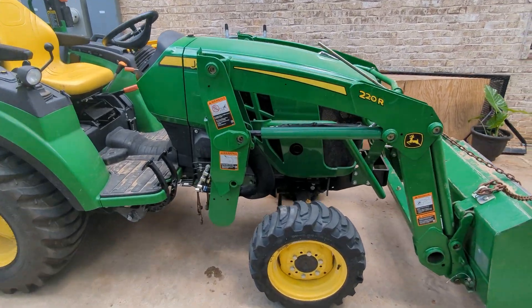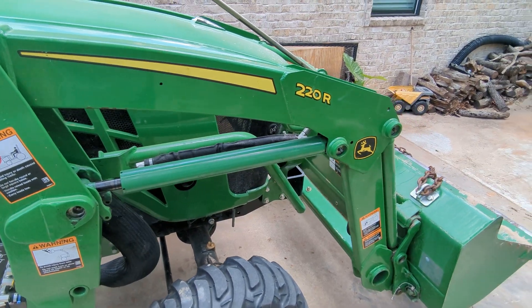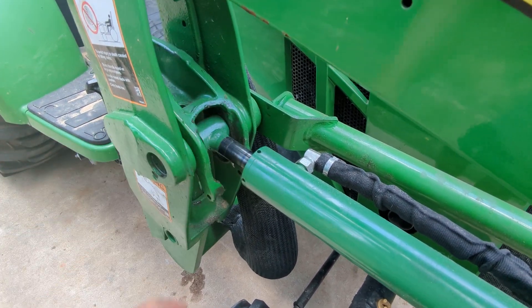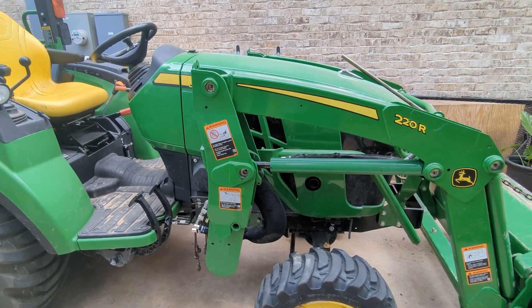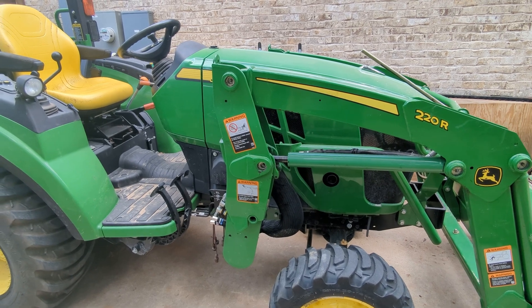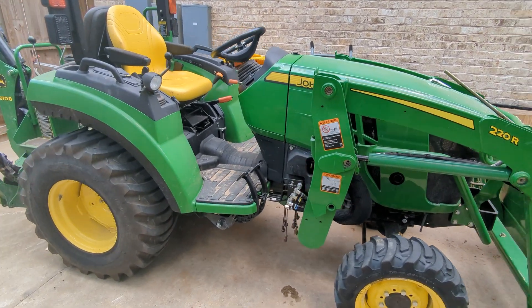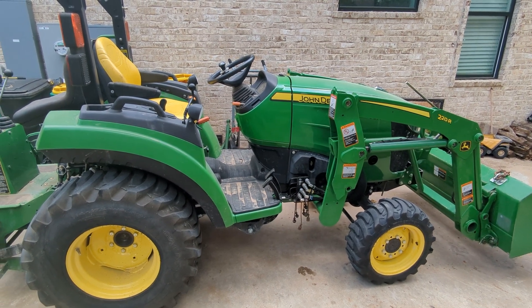What we're doing today: we've got the 1.75-inch bore cylinders. You can see there's no interference here, and this diameter will fit between here as well, so no issues around scraping on the end side. I think this is going to lift more than most people are going to want to lift. Assuming you put your pressure up to the upper end, in an ideal world this would lift a ton off the ground, maybe a little higher — but we'll see what it does.